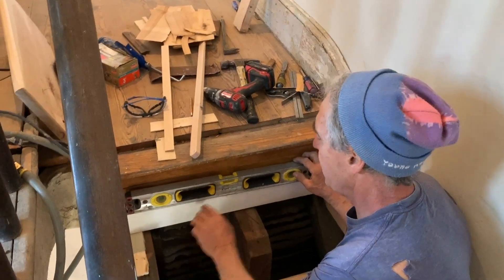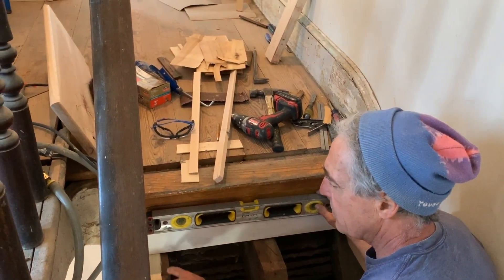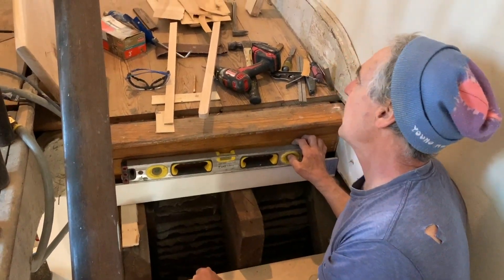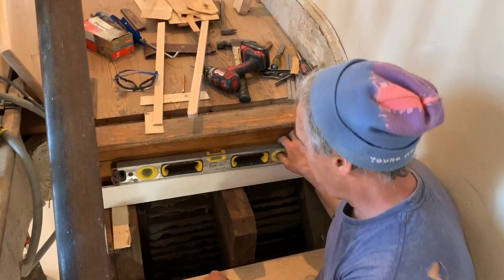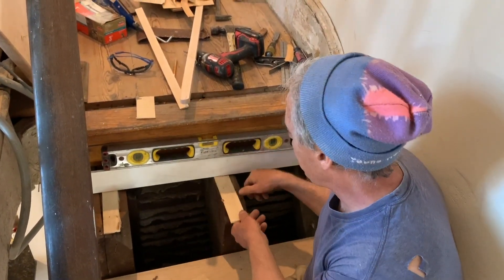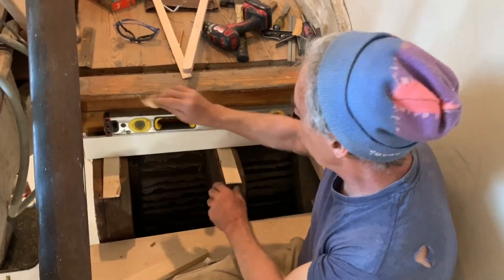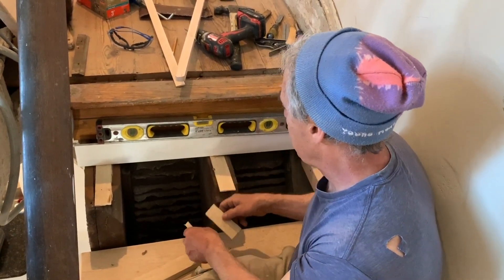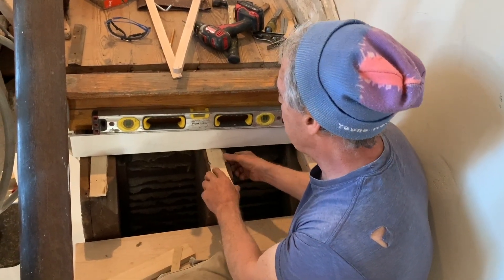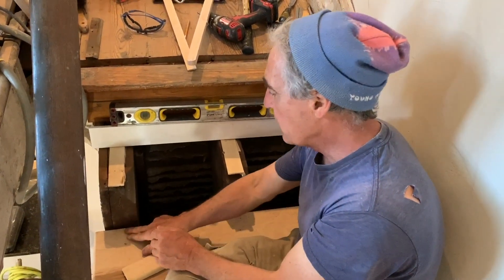What I've been doing all along is going to that low point and shimming it up and putting them onto the stair stringer. I'm adding a shim of some sort - I have shims of different thicknesses: three-quarters, three-eighths, half, whatever it takes to get this good. Then what I have left over is a space under here, so I have to pick out a proper piece that will get me to that spot. In some cases it takes a little finagling, cutting pieces up, but basically I need to get this filled in so this line is nice and level.